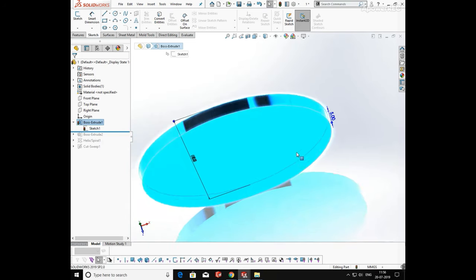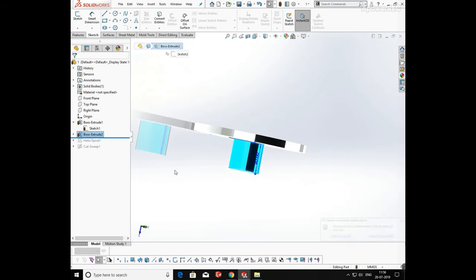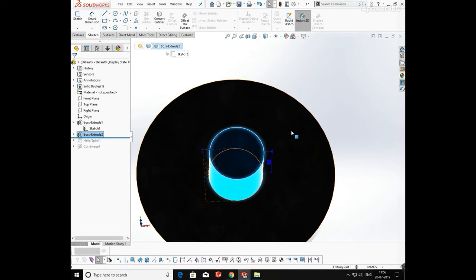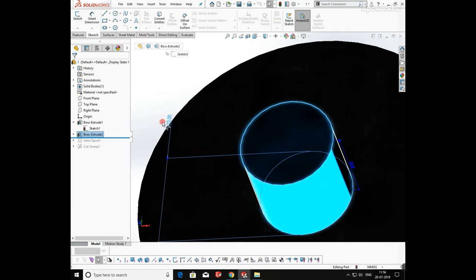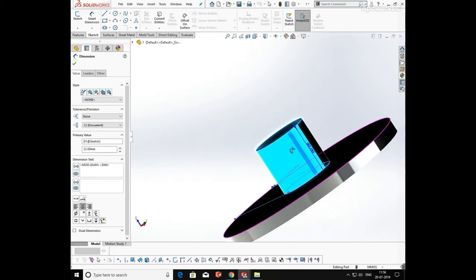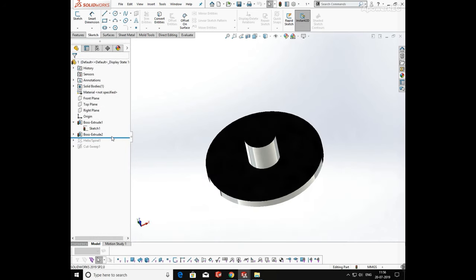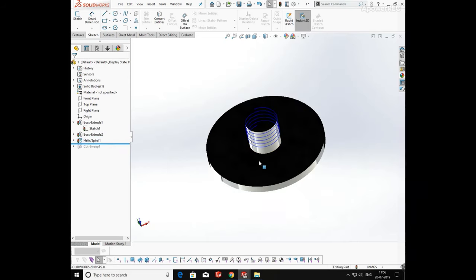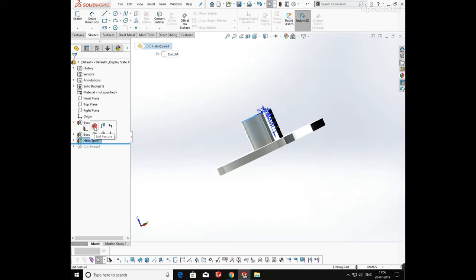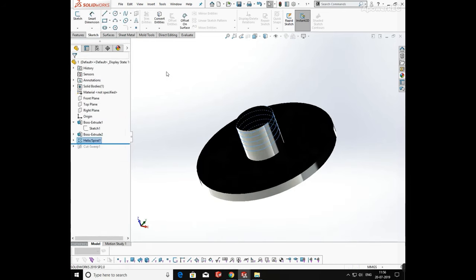Now the next part is the handle base fitting part. For this you have to extrude base a circle of 80 mm and thickness is 5 mm. Now again extrude base, draw a diameter of 22 mm and extrude it base up to 20 mm. Now draw a helix